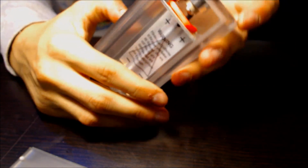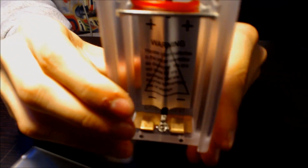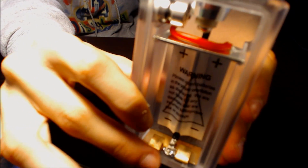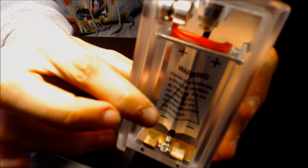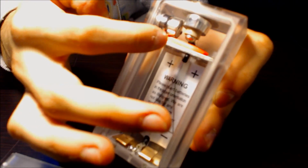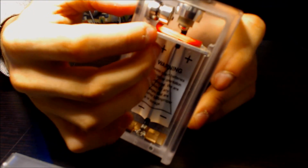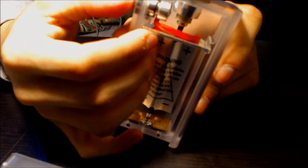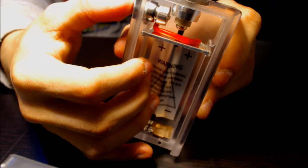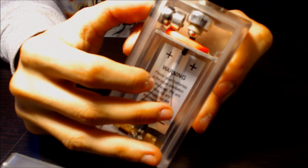So you have 14 gauge solid copper wire running through this. Solid copper wire in the back. The black wire in the back, if you can see this, connects the bottom negative all the way up to the 510 connection right here. And then you have your positive, which connects the top positive bar onto your switch. So really what you're connecting is your negative. So once you push, it connects your negative. It completes the circuit with the negative. And that's always nice. That's a mechanical switch. It just makes connection with the 510.